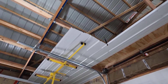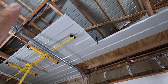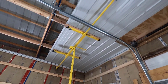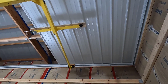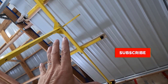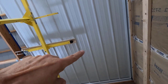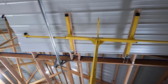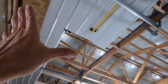This panel is up, but with the amount of overhang the only place I can clamp it is right on the end rib there, which is just fine. All that really needs to happen is that that rib is exactly over the previous rib all the way down. I'll trace my line for the screws, push it up nice and tight, and get that first screw in. Then I'll work my way to the other end to flatten the panel out, then come back with the staple gun.